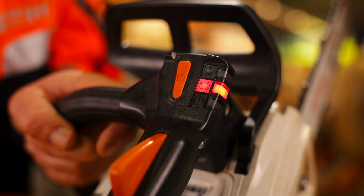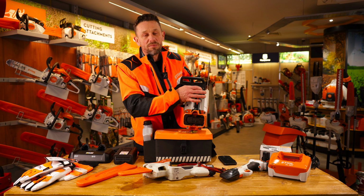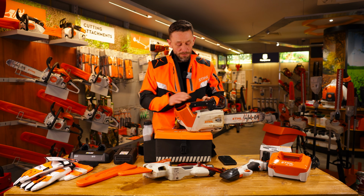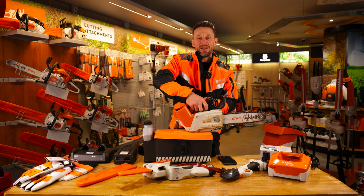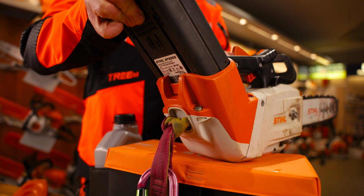Now with the standard one, this panel won't light up if you're running out of oil. That model is the TCO. Moving backwards, we've got our dead man's handle here. Trying to press the trigger just will not engage unless that's down, hands round, and you're doing it. The back is the port for the battery.